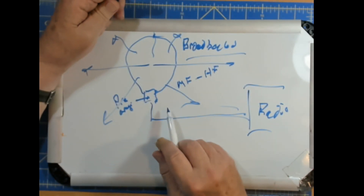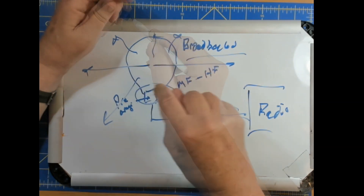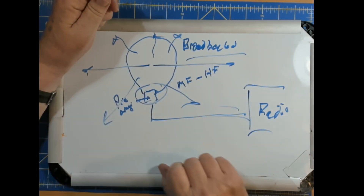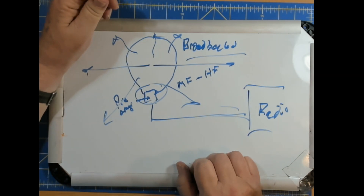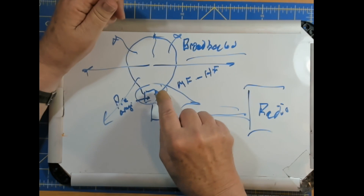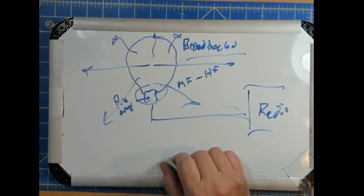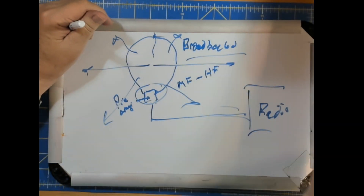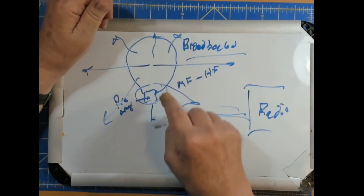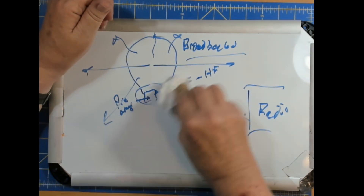So that goes to the radio. The expense comes in the broadband part, and also partly in shipping a loop like that. Some people ship it in a great big box. Others do it by giving you a piece of coax that you connect from end to end — the shield on that acts as the loop antenna. Or you can do an electrostatic shield, meaning grounding the shield and then using the center conductor. You've got so many options.